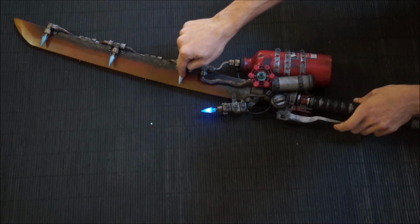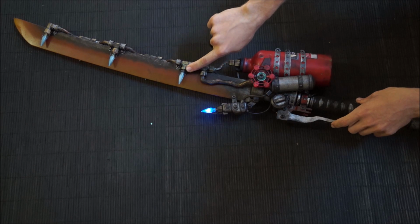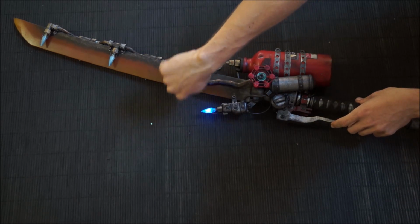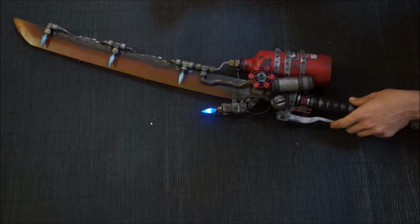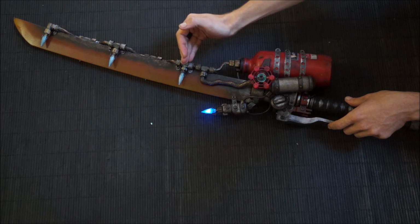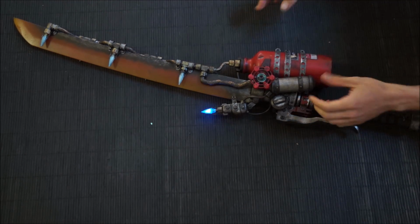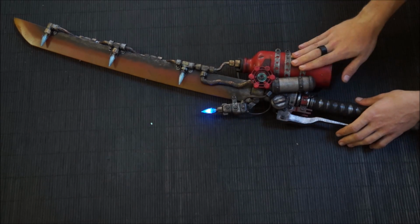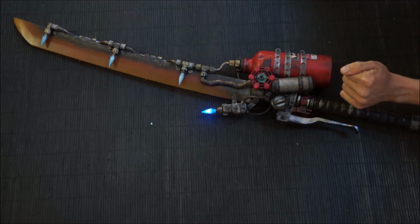Now this flame jet is actually special. You can see it's a little bit different. If I pop this off, this is actually a valve that I drilled out in the middle of it. So when the valve is open, it acts as a flame jet. It's an output for the system, but when it's closed, it fully locks off not only itself, but all the ones downstream from it. So this means if I open both of these up, fill this with water, and activate the pump, I can theoretically pour 6 drinks at the same time.